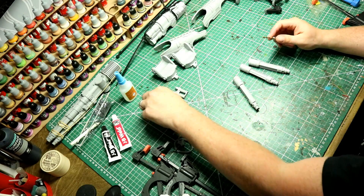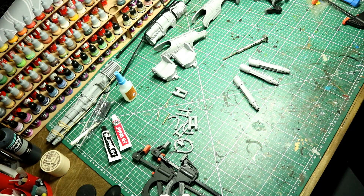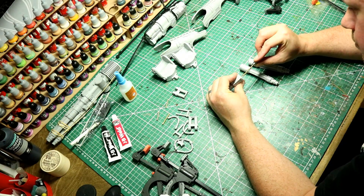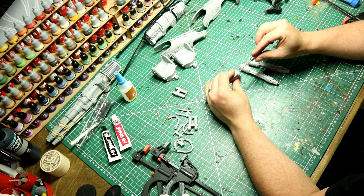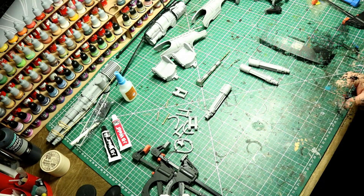What we're going to do is get a three millimeter drill because that will match your three millimeter brass rod. I've got a pin vice drill here, but pin vices are not really good for doing this kind of thing - you could be here for hours trying to drill out one and a half to two centimeters worth of resin.